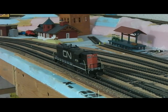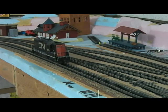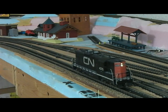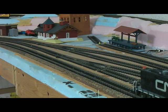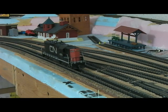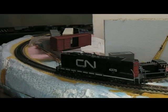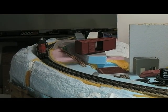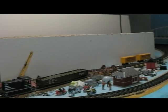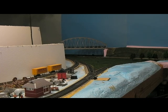After a certain amount of swearing and fiddling about to get the shell on, here it is. Those light tubes work really well — they put a lot of light out the headlight with no spill and no glowing on the side of the shell. That's excellent. Now notice on the hill here it's not slowing down — that decoder has back EMF, and a fairly decent implementation of it too. I'm pleased. It didn't stall out on the turnout either, like a lot of locomotives do.